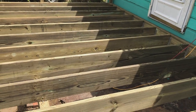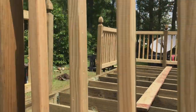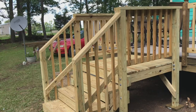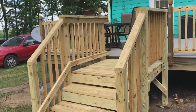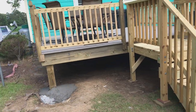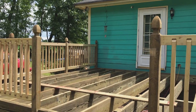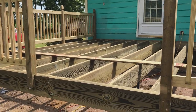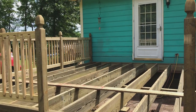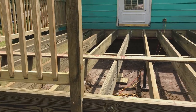We bought a set of steps that were pre-made with a landing on it — it should be 55 and an eighth of an inch, the guy said. So I made the hole 56 inches wide, and that should sit really nicely in here. I'll show you a finished view of what that looks like. There you can see my sort of construction — it seems to be very, very rock solid.